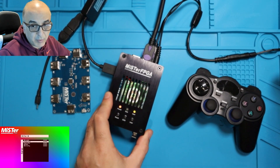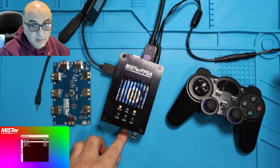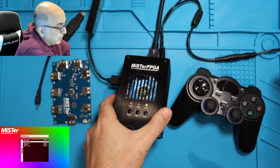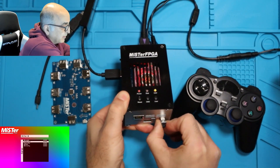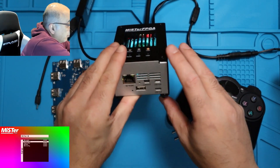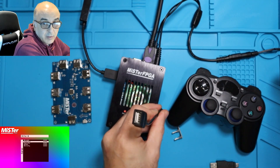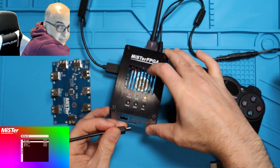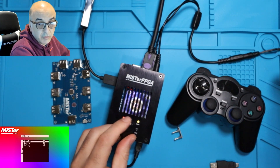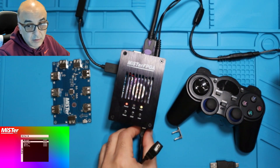So that's basically what you need to know. But if you still have trouble, there's two other things to check. The hub could be bad or the DE10 nano board could be bad. First thing to do is make sure your DE10 nano is working. Disconnect your bridge and take it out. You have a USB port here which is your DE10 nano. If you connect a cable that has a USB port on one end and a micro USB on the other — you can get a cable like this from the iCode website or Amazon — connect that here and then connect this to the USB device, that will verify that your USB port is working on the DE10 nano.